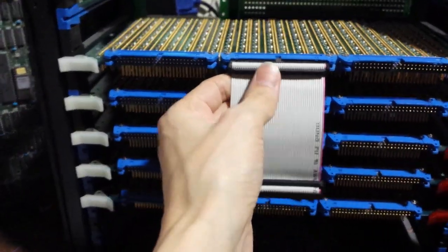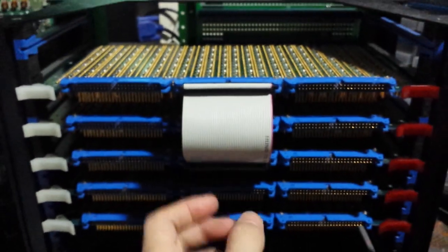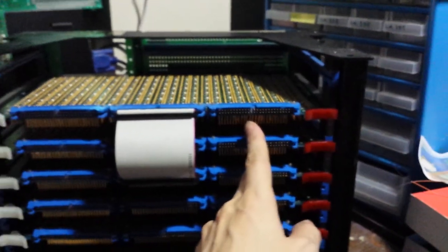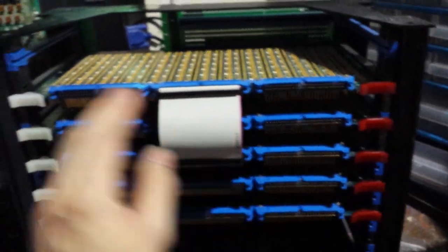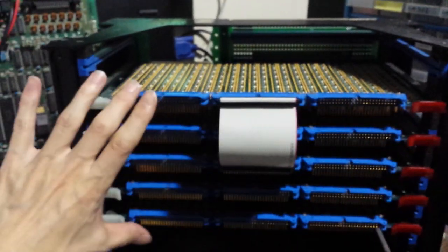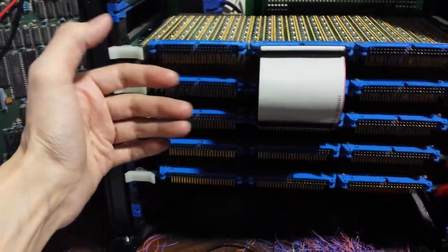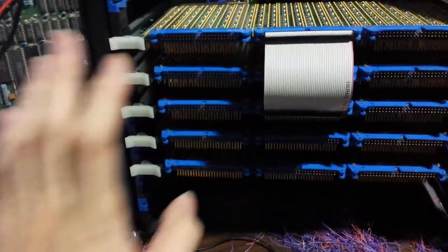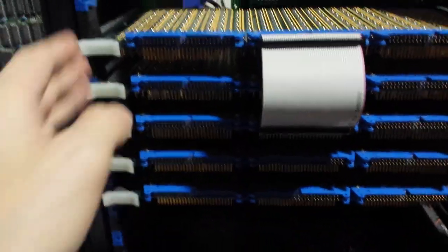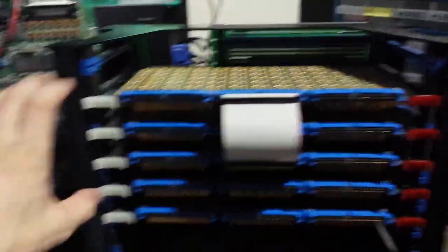At the beginning I will connect IDC cables like these between the cards for them to communicate. Then probably after, I want to replace this with a front plane — a PCB with connectors which can be easily removed. This PCB can also come out and be put in to connect the cards, also wire-wrapped.